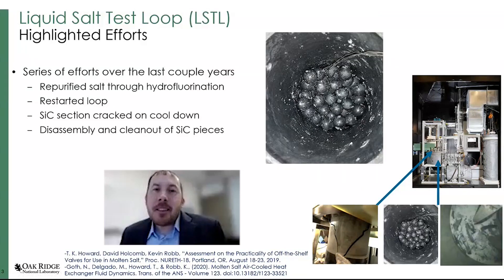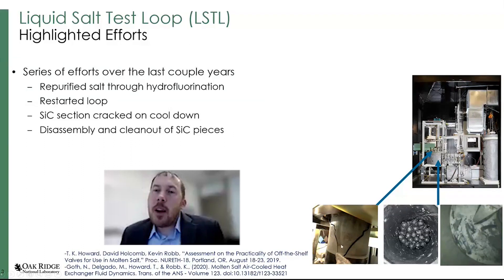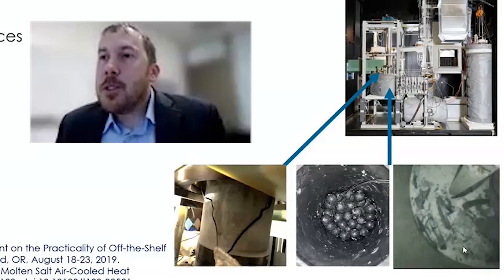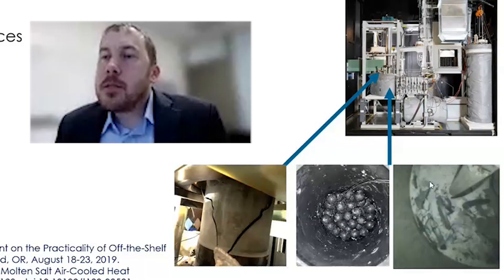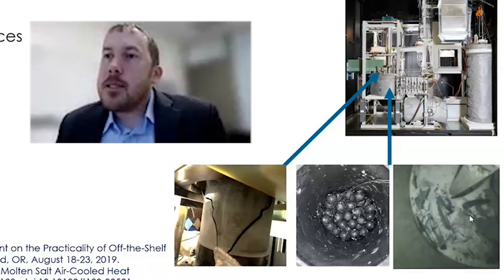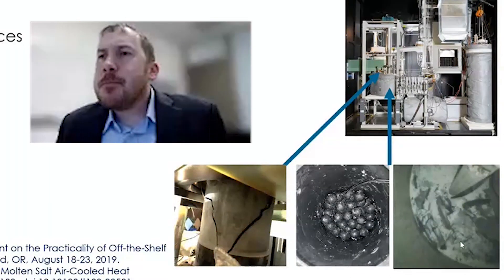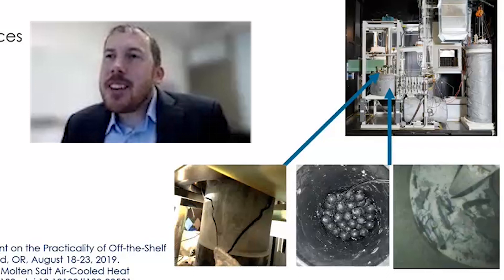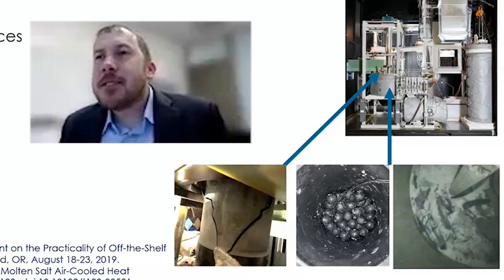A bit of effort, disassembly, clean out, and restoration of the loop was required. The silicon carbide tube was a primary member — salt was flowing through it and outside of it was air — so you can't run it when it's cracked. We took the pebbles out, and inside the tank, when the tube fractured during disassembly, it produced little chips and pieces that fell down into the pump tank. The salt is white, and sitting down there were these little black pieces of silicon carbide. This presented an opportunity to do some remote activities of removing these materials from a hard-to-access area.